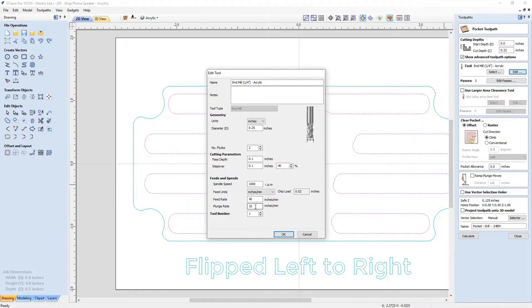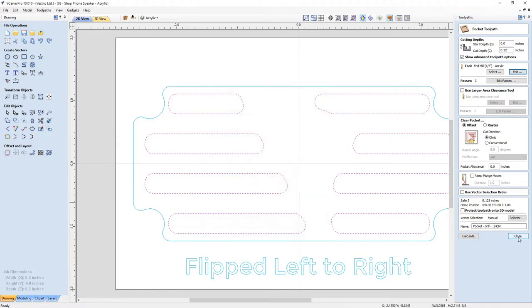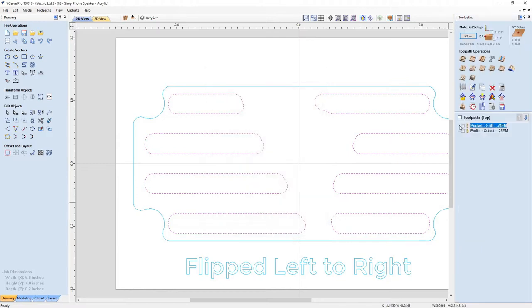And hopefully you won't have that problem by not using a double-sided tape inside your cut area. That's the biggest top tip ever. So these are the settings that I used, and it worked out perfectly fine. The chipping was great. It didn't melt. There was some strings on the end of my cutter, but they peeled off really quite easily. Carefully, I took them off not to cut my fingers. So these settings seem to work great for this particular cutter. And that was great. So let's just go ahead and close this and let's preview that tool path.